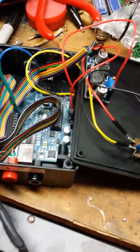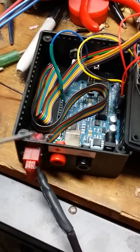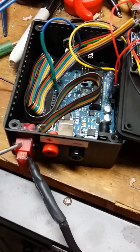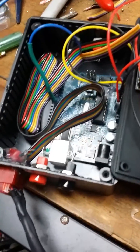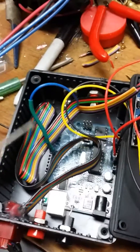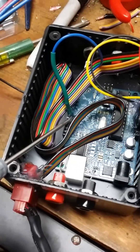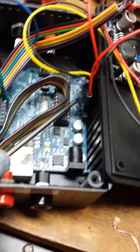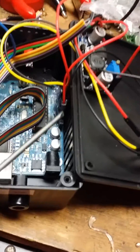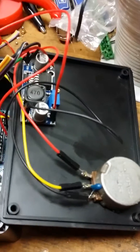I've put the Arduino and all the electronics into the old project box that I had, and I reused the connector from the treadmill here so I can unplug that. I glued that in on the back side so it's in there real tight. I put the resistor in the heat shrink here and then glued that to the header. That is the output PWM pin, and I did the same thing as far as gluing the pins to the header over here for the power and the input from the rheostat or potentiometer.